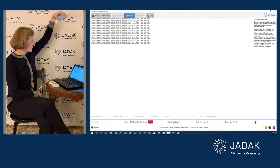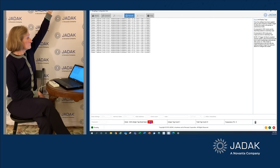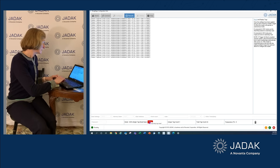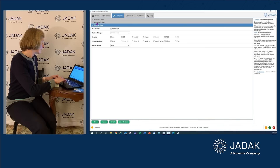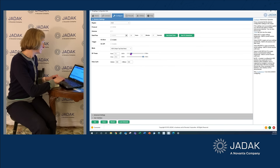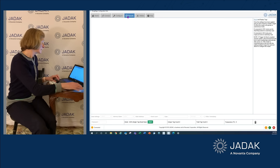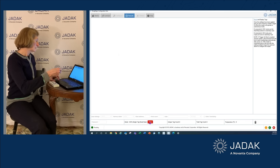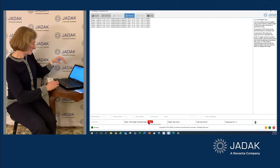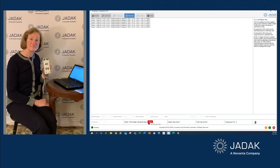Pretty good little antenna, reading pretty far — maybe 30 inches or so. If I want to change the settings, simply hit Stop, go back to Configure, and now I'd like it to read a shorter distance. So I'll take the RF power down to 1 dBm, hit Save, go to the Results tab, and start reading. The read range is now reduced to about six inches. That's how easy it is to start reading tags with the ThingMagic Alara — easy peasy.